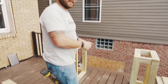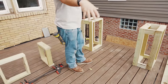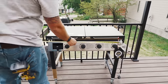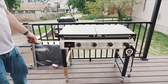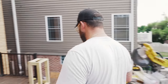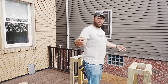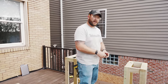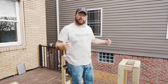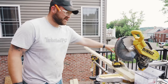Anyway, we've got our two outside boxes here. These are going to be our countertops and the outside pillars of this thing. Now, if you're going to do something like this yourself, it's important to use relative measurements. We're using the bottom of our griddle — 37 and 5 eighths, call it 38. Our stone plus the backer is roughly 2 inches, give or take, on the interior. So we're going to go 42 inches. We're going to put two 42-inch stretchers in there, and then to make sure it sits in far enough, we're going to drop those down. Get all that mocked up, put together, and then pour a concrete pad in between them. Let's cut a couple pieces to 42.